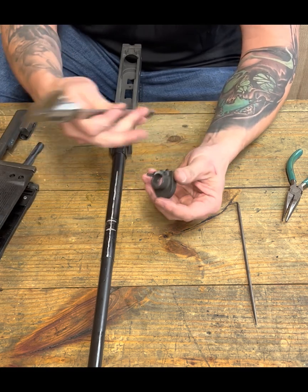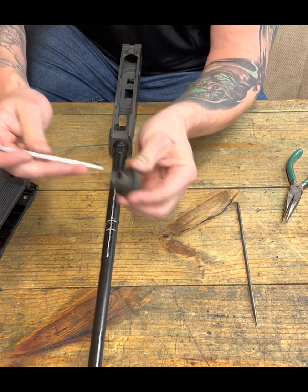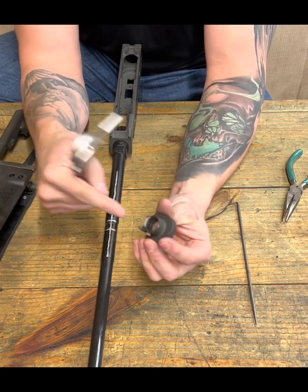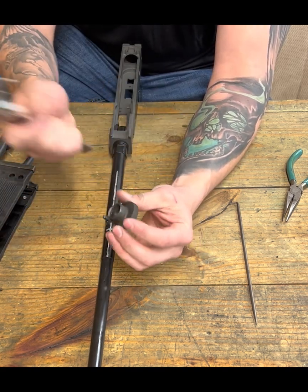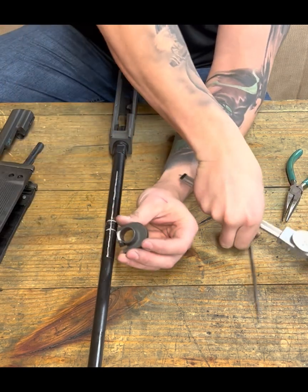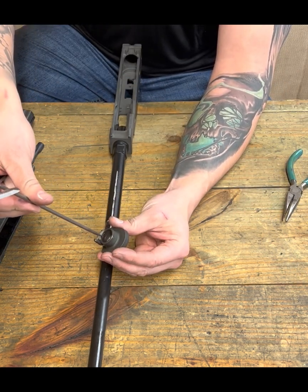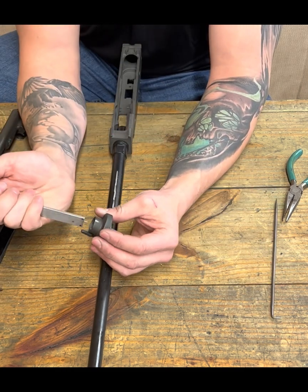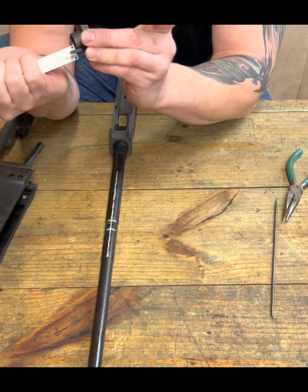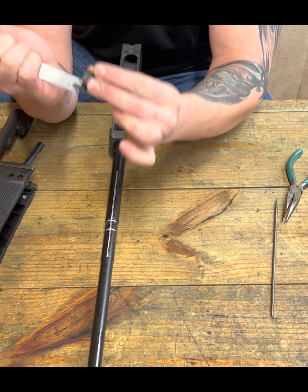You want to check from the leading edge here, and we say, okay, if I put this in the center, I know it might be difficult to see this, we can use our calipers to measure from this shoulder and say, okay, if I go to the center of the pin, I'm just going to call it a pin, that's the distance that I want to measure out with my calipers. And I always look from both sides. Check her out from behind too, you know what I'm saying? So yeah, that looks pretty center.